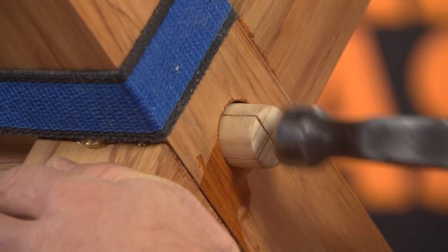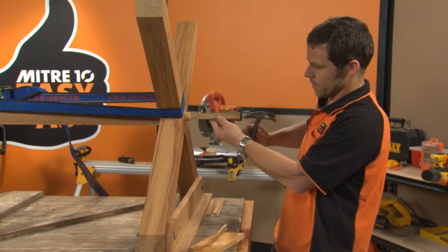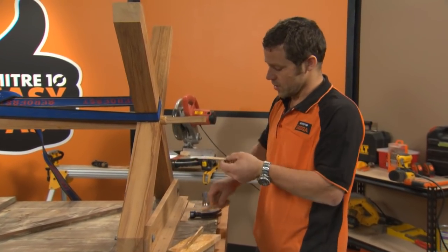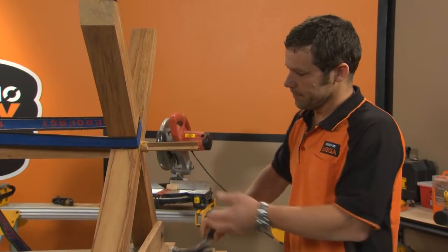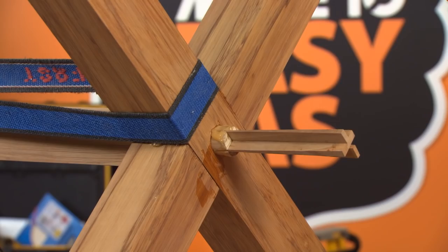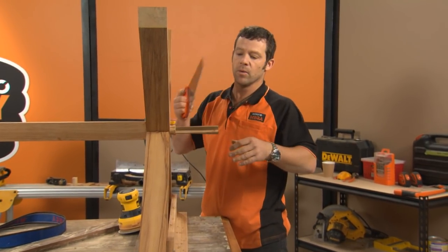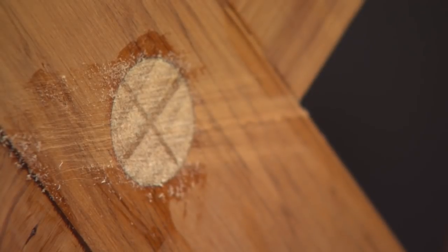Now force a little bit of glue through the sides of that cross. We're going to take a nice long wedge made out of rimu, and we've got two little wedges to go on either side — this is going to form a beautiful little cross on the end and set that down nice and tight. She's all glued up, everything's set. We're going to let this glue dry for about 24 hours, then chop that off. Before the glue dries, wipe off any excess. I've got a nice sharp fine panel saw — just real gently. Now just give it a little tickle up with the sander.